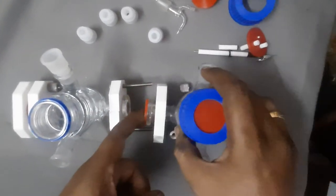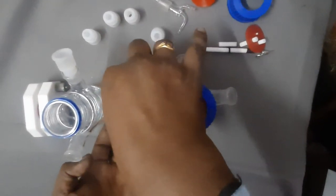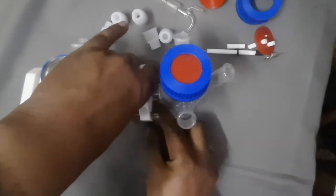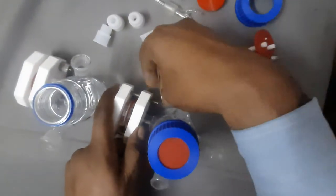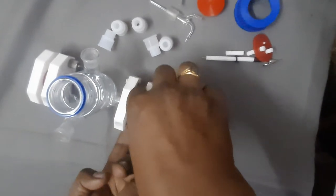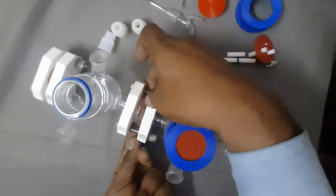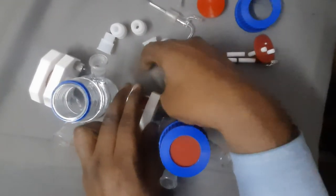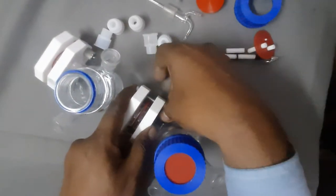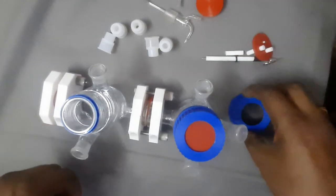Then fix it back. Just fix the nuts and finally we can align the membrane properly. Okay, before final tight, just align the membrane position. And tighten it. Just a firm tight is sufficient. Since silicon gasket is involved, it's purely leak tight. Then position the electrodes.